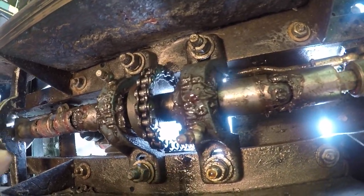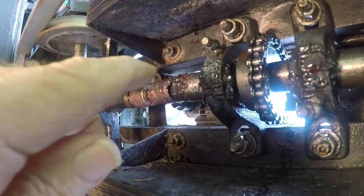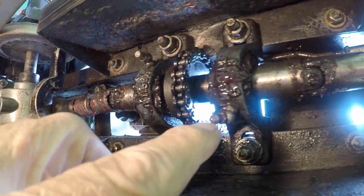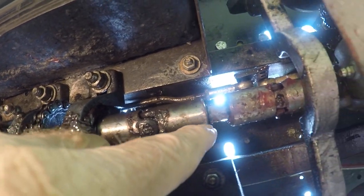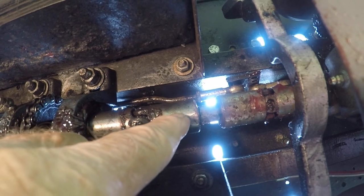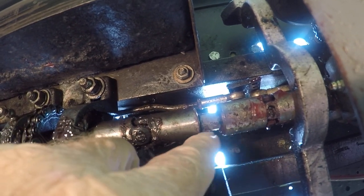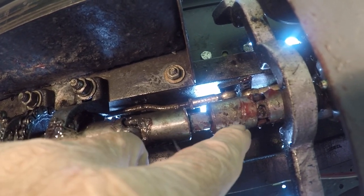You have a short shaft that goes into a universal joint on each side. From there you go through a spline — it's a half-inch hexed spline. This matches this. The hex shaft just floats between these two universal joints.